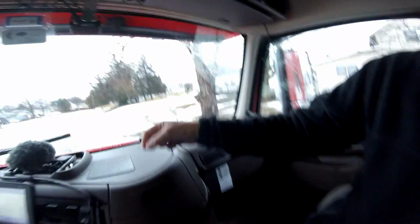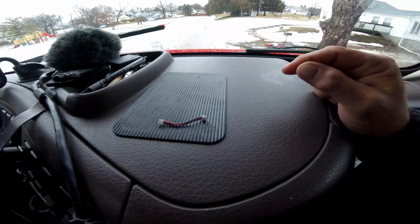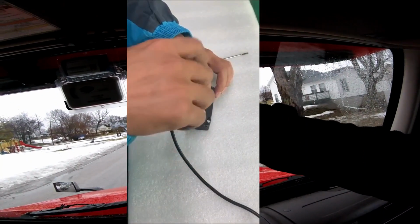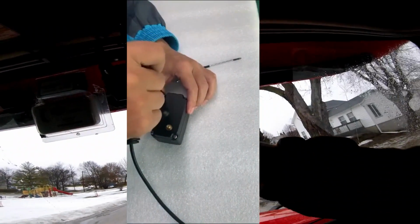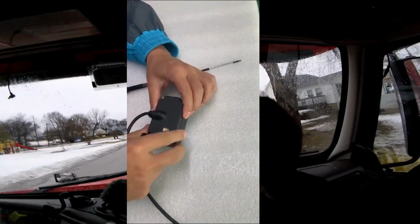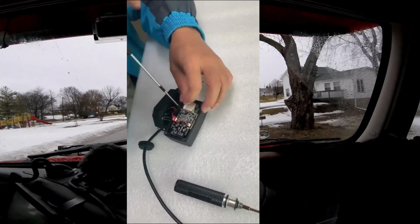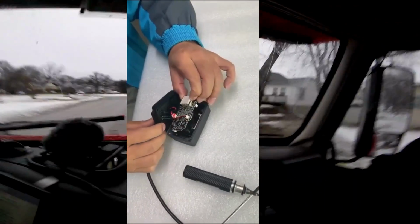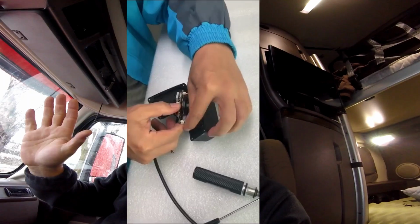So he sent me a video showing me how to remove, let me set it down here so you can see it better, this little cable. Now, before anybody freaks out, there's 4 Allen screws on the back of this camera. That splits these 2 halves apart. You pull it apart. Inside there is a control board, and there's, I believe, 2 or 4 screws on that. You take those out, and the cable is right there, you unhook this cable, and what that does is it shuts the infrareds completely off because they can't get power.